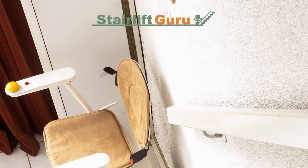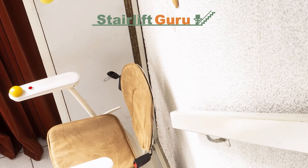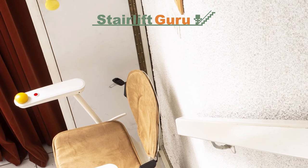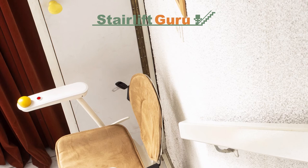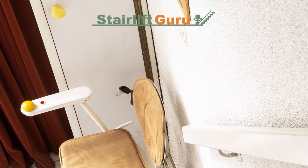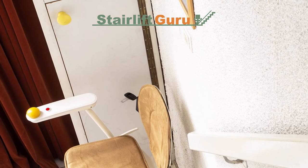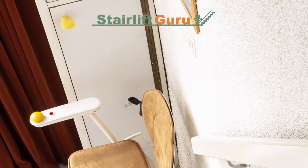Is there a warning signal on the stairlift? Just like driving a faulty car, a warning signal should appear if there is a serious problem with your stairlift. You may see a flashing light, or most commonly you will hear a very annoying beeping sound. A series of beeps that you don't usually hear may indicate that your stairlift has broken down. If you've noticed this, you will need to call a professional. As well as listening out for warning beeps, try to pay attention to the general sound of the stairlift. Does it sound a lot clunkier than usual? Is there a grinding noise as it tries to move up and down? These are also signs that it may be breaking down and needs to be taken care of by an expert.